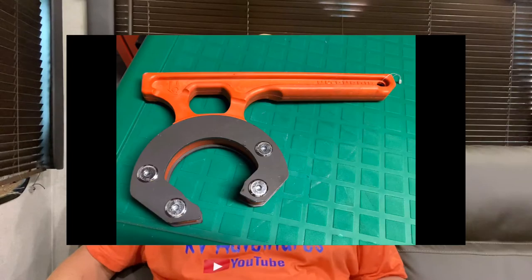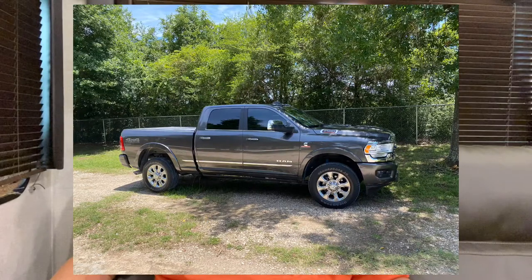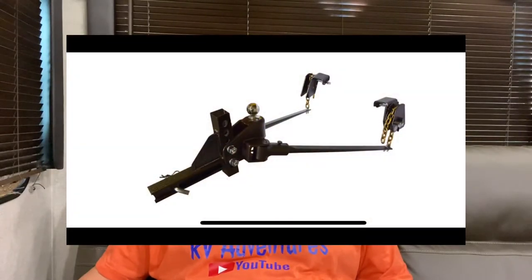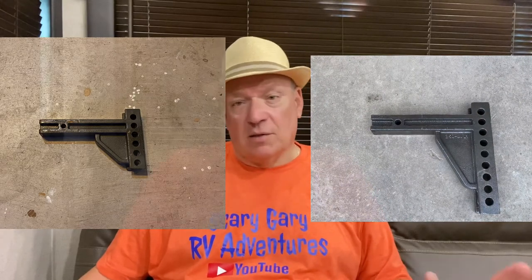That second video was the hitch grip, which was kind of the ultimate idea of the neat stuff. But the problem I had when I went to the Dodge 2500 — the three-quarter ton — the hitch grip wouldn't fit. Basically, I had a Blue Ox weight distribution and sway hitch, and the hitch itself had I don't know, five or six holes. When I went to the three-quarter ton I needed to get what was called a nine-hole, and I think it cost $175 to put that on there.